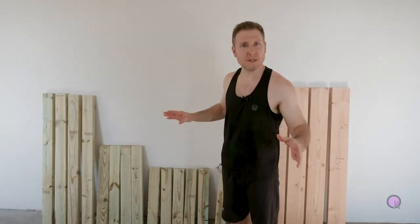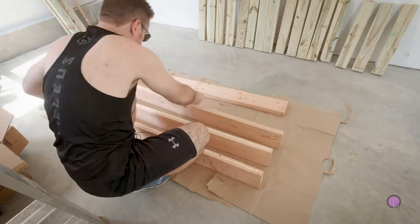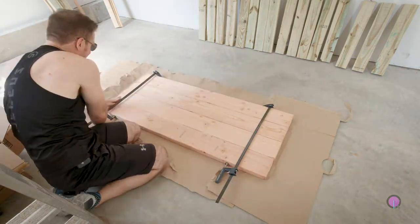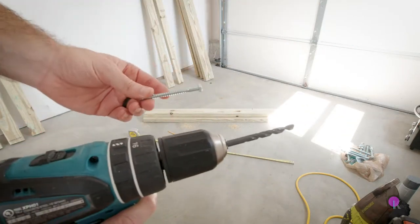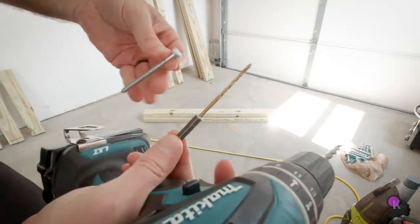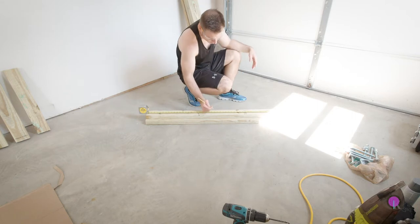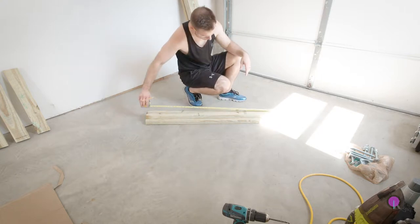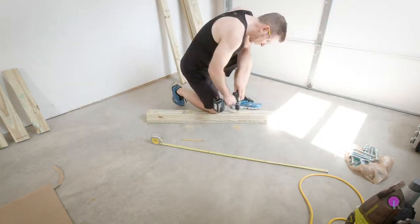Alright, let's get started actually assembling this. First things first, I got to make sure that the top gets done — I just lay out the wood, glue along the inside of each board, clamp it together and let it sit on top of something so I don't get glue all over the garage floor. I'm going to use lag screws for the frame, so I need to drill out the shank about a half an inch and then drill out pilot holes so that the torque from screwing them down doesn't just rip the tops right off the lag screws. Now it's just a matter of measuring out the intervals to secure the support beams perpendicular to this — there are four of them so I just need to measure out four even intervals, then drill out the shank holes and the pilot holes.